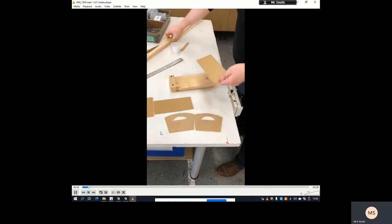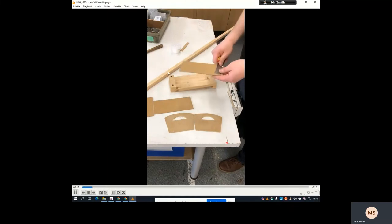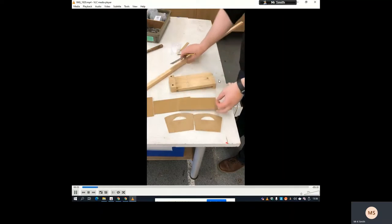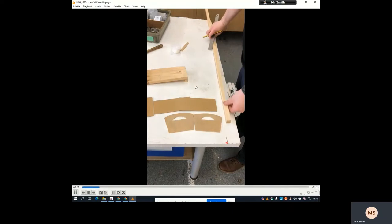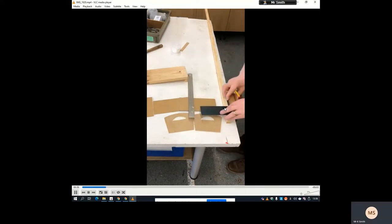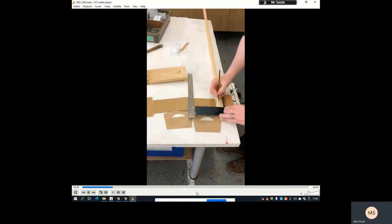At this stage I'm going to glue and panel pin some 1x1 timber to the two sides. I'm measuring the size of them — it's around about 80 millimetres. With my metal ruler pushed up against the edge I'm going to mark 80 millimetres. Then I'm going to use a tri-square just to make sure it's square — push the stock against the side and draw a line down the side so I can see that I'm sawing straight, to be nice and accurate with it.